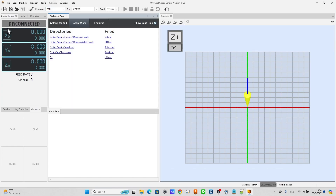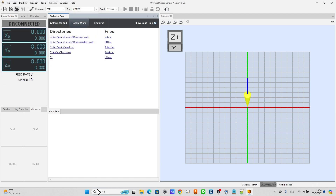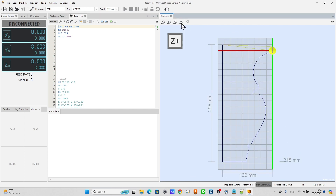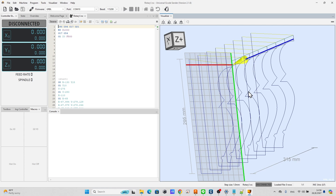Open the G-code file. The NC7 foam art machine uses the Z-axis to control the rotary axis. You can see the toolpath display with layers along the Z-axis. Click here to change the view to top view. The G-code editor is still not perfect — we need to edit the G-code manually to make the machine move faster outside the material. This is the built-in G-code editor. When you press the direction key up or down on the keyboard, you will see a yellow highlight in the visualizer.